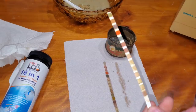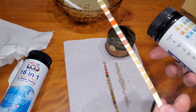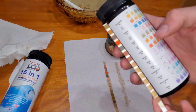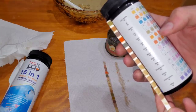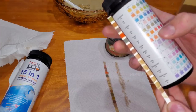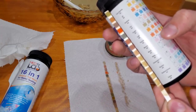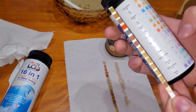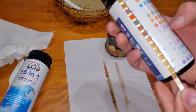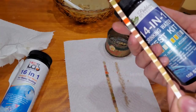Let's take a look at this first test. They're not exactly accurate since it wasn't completely clear, but obviously orange is telling you there's something wrong. The total alkalinity is around 80. The pH is around 6.5. The hardness I'd say around 50 or so. The iron is off the charts — around 6 or 7 parts per million. I don't think there's any copper. Lead is probably around 5 parts per million, which is not terrible compared to some things we've seen before. There's no fluoride, no mercury, no nitrate, no nitrite. Just a ton of iron and some lead.